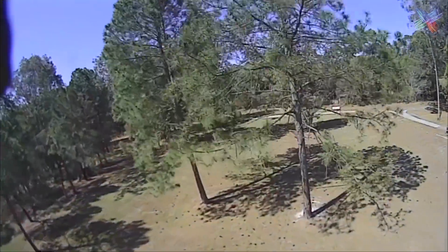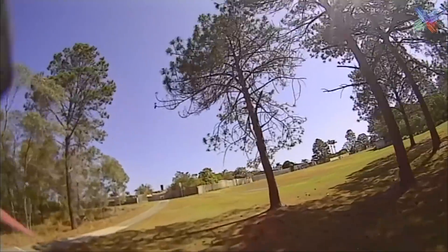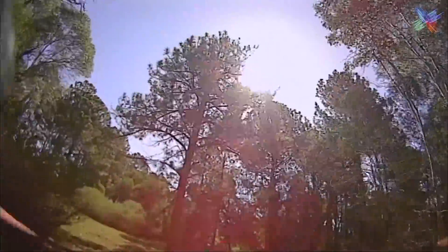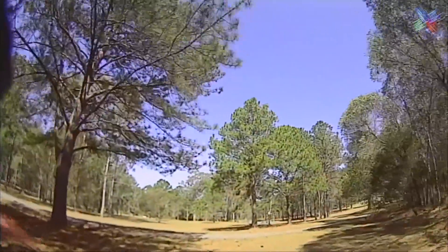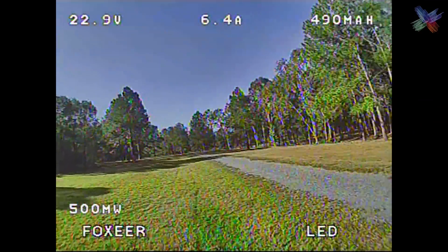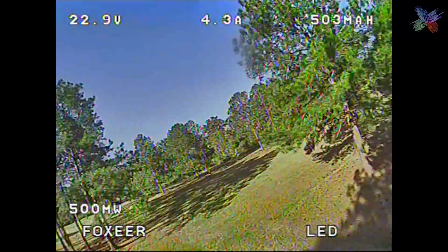What's more important to note with this footage is how the signal degrades. Unlike the DJI, which adds a blurry JPEG-like compression, the Byte Frost just drops out little parts of the picture, and the way it degrades to static is actually really analog-like — it's really easy to fly through. There's no variable latency; it's intuitive if you've come from analog — it just makes sense to your brain. You'll see it gets a bit sketchy in places but it's completely fine to fly through. The way it degraded felt a lot less jarring than the DJI, and flying felt better due to that consistent latency.